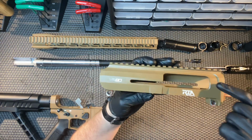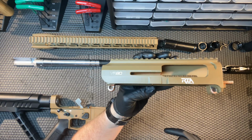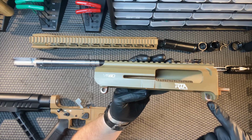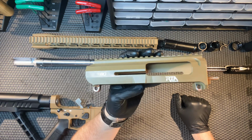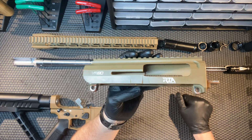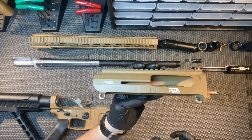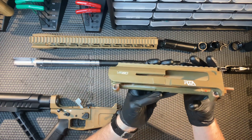On this gun in particular, this Coyote Cerakote, whatever color you want to call it, brown, I don't care, where the takedown pins go, okay? That Cerakote has added extra material and has made this gun a pain in the butt to separate the upper from the lower. So I have greased that as well as greased the inside, because that Cerakote was on the inside and it's caused the takedown pins to be ridiculous to reinsert.